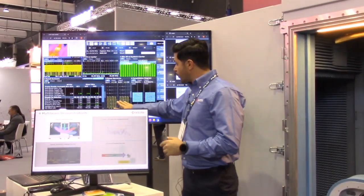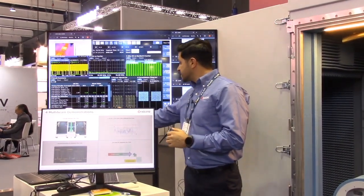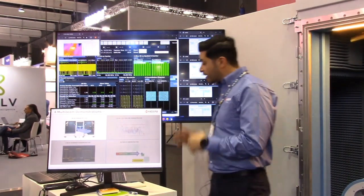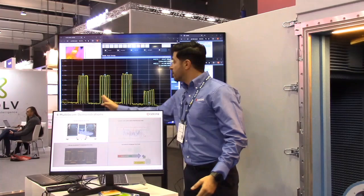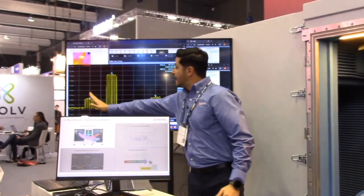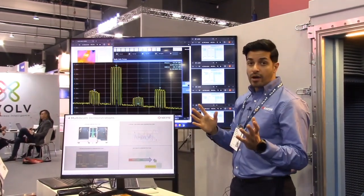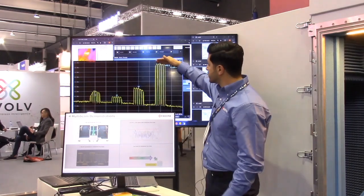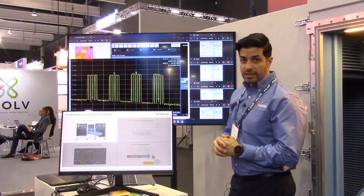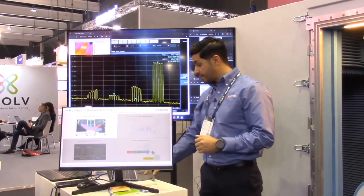You see these four beams here — all four of them have great EVM, and each one is 50 megahertz bandwidth. For the first demonstration, we are going to start toggling the beam, meaning pointing the beam one by one at each different reflector, then combining two subarrays, and then starting to point at four different subarrays one at a time. Eventually, we are going to combine all four subarrays together into one strong beam and start pointing at different angles at each reflector inside, and then go through the same loop again.